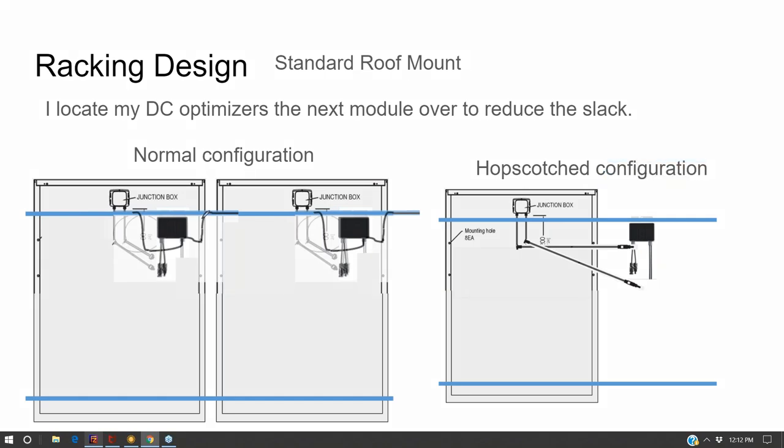The problem with these voltage regulators that go underneath the solar panel is that you have to juggle the solar panel when you're mounting it down onto the rail, because you have to plug the solar panel into these boxes, and then you get a bunch of loose cable that gets all messy that you have to manage. But that loose cable is inherent to it because you have to rotate the module into place, so you need that cable length there. Otherwise, you can't plug it in before you mount it.